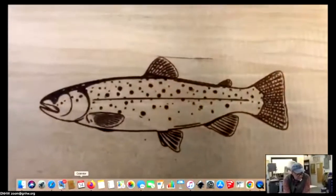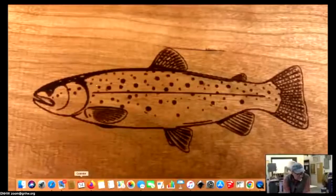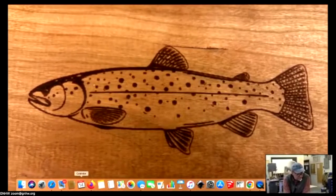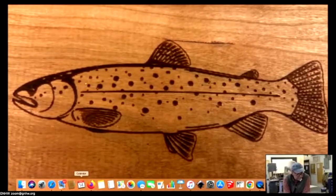The traveler moves back and forth at 40 speed, traveling 100 times per inch of vertical design space. As there's more horizontal image to cover it travels further. Two minutes in you can see it traveling the full length of the trout. As it gets down to the lower fin it starts to travel a shorter distance — you can see the sparks flying as the laser burns into the wood. When it finishes, the traveler returns to center. There's the finished product on raw wood, and here it is with one coat of wipe-on poly to show the rich colors you get with cherry and wood burning.